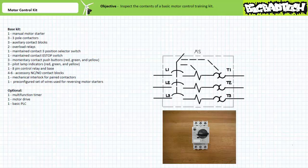Let's start by examining the manual motor starter. The manual motor starter is a three-pole contactor and overload element integrated into a single package. The contacts directly make or break connection to primary voltage based upon the actuation state of the rotary dial on the front. The integrated overload elements protect the motor from sustained overload conditions. Additionally, this manual motor starter also serves to protect the circuit from high-current events associated with short circuits and acts just like a circuit breaker. It features an adjustable dial on the front used to set the overload current, and can be used to directly start a motor or to functionally isolate pilot and primary voltages for test and troubleshooting purposes.